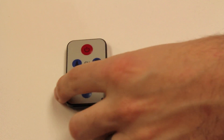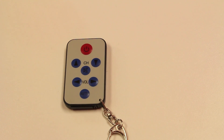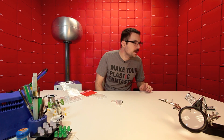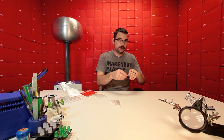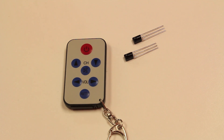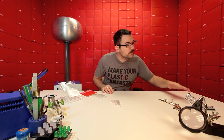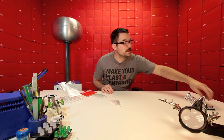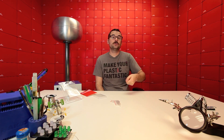First up, we've got this remote control — the same IR remote control that we've been selling for a little while now. It's basic on, off, channel up, down, mute, stuff like that — just a nice handy little keychain remote. We also include these two infrared receivers. What you can do is plug these into a breadboard, plug them into your Arduino, point the remote at them, and receive commands. The nice thing about these is they're the standard infrared receiver frequency you see with TV remotes, so instead of using this remote, you can just use your standard TV remote to control your Arduino.